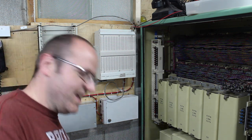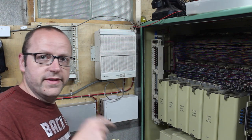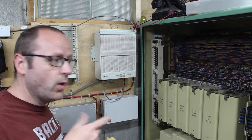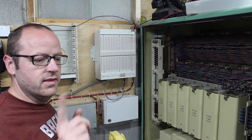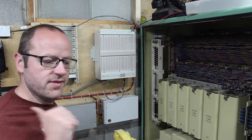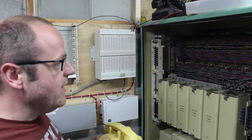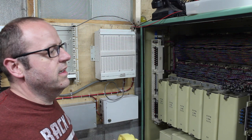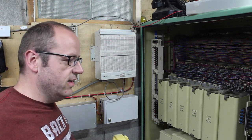So that's kind of neat. I didn't actually realize, I've never paid too close attention. It's a 25-pole uniselector that's acting as the interrupter, but it's wired as a 50-pole, so it has two brushes. So one brush enters, does 25 steps, and then it leaves, another brush enters and does another 25 steps. Because it steps, it's pulsing twice a second.